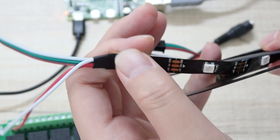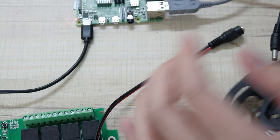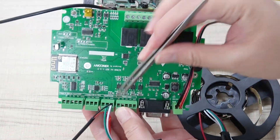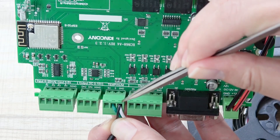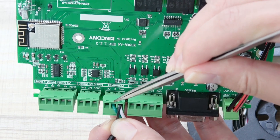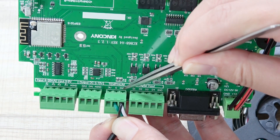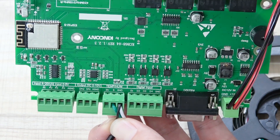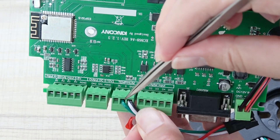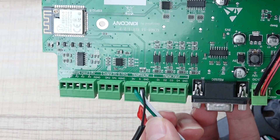This is our A4 board. The A4 board has a socket — this is the socket for the DS18B20 temperature sensor. The S signal goes from this socket to the ESP32 module, and this is ground. So we can use this S signal and ground. I've connected the S pin with the green signal wire of the LED strip, and the ground with the white wire.